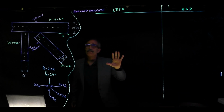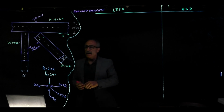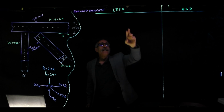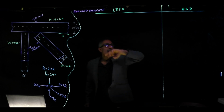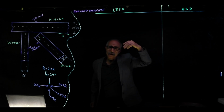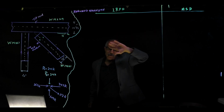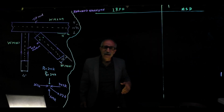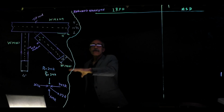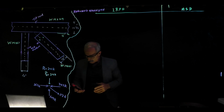And one of the first things we want to do, because of what this load is given to us, let's calculate the required strength. We're going to use both methods of design, load resistance factor design and allowable stress design. If you don't know what those two are, go on my channel. I have a video on the difference between them and why we use this or that. Story for another day. So we're going to calculate the strength of this load based on these two types of design. Let's get to work here.